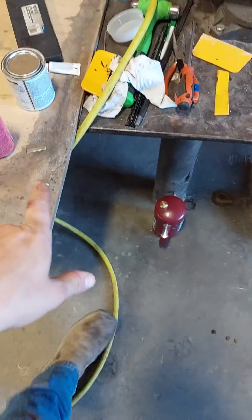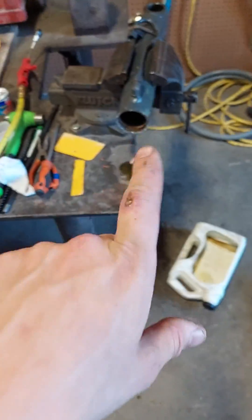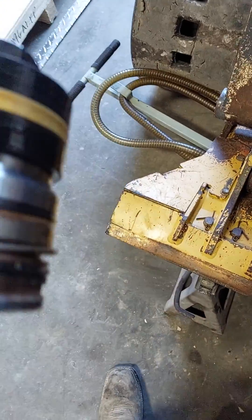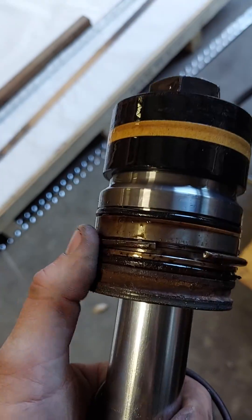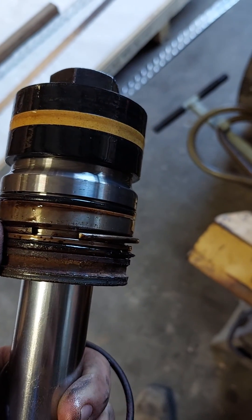If you break your installation ring, make yourself up some Bondo and fill that groove - you'll be surprised by how easy it comes out. Because what you're going to be fighting is this snap ring that sits right there. You've got to get it out, you've got to get it past that, and it compresses in there real tight.